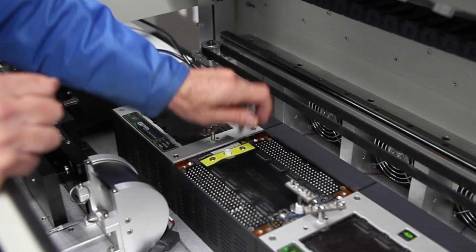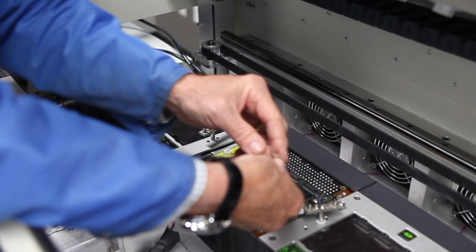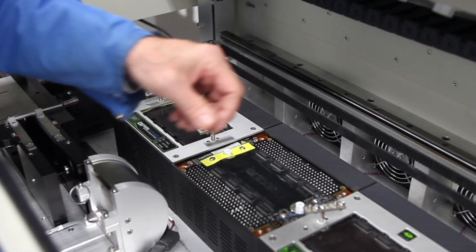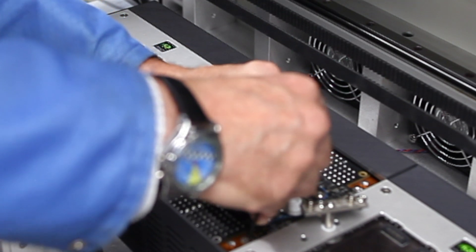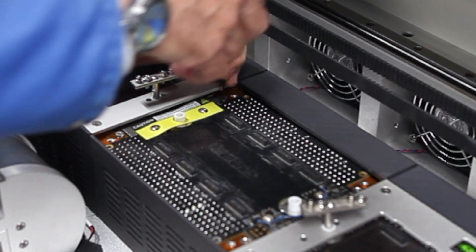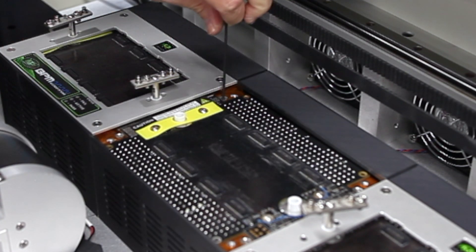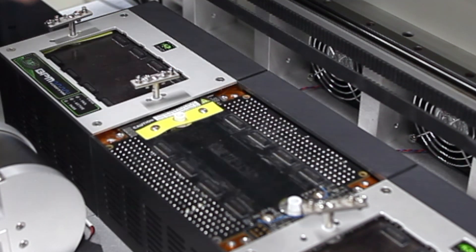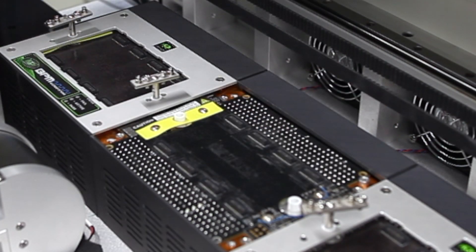Go ahead and remove the T-posts, because they have to be removed to put the cover plate on. We'll reinstall the four corner screws and snug those down. These do not have to be tight — they need to be snug. After that, we need to install the standoffs, one at each corner, to accommodate the coming screws.